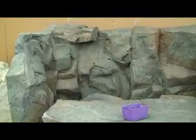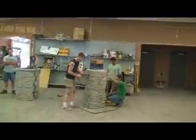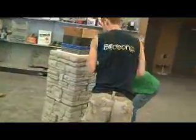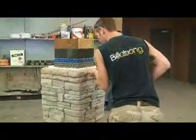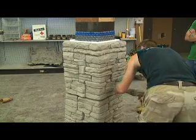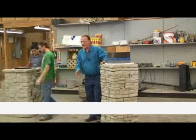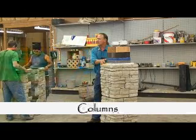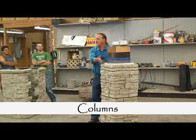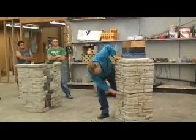Cutting mud. It looks like they're just adjusting the column rocks here. These are the outside corners — four of them go around the column completely, and we're going to have to touch this up. Just adjusting it now to get it all kind of torqued in. What I saw Skyler doing when he was installing this — one thing you have to think of: on the 16-inch column, we've given you an extra inch, so you need a half-inch space. You could use some shims, but leave it loose until you get all pieces in place, then snug up and adjust.